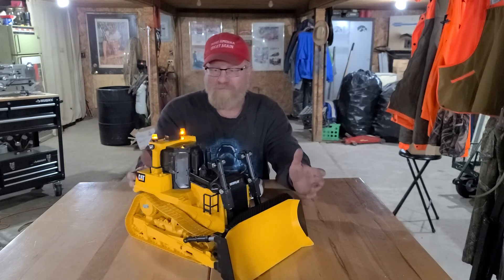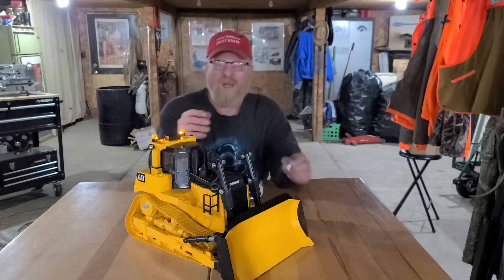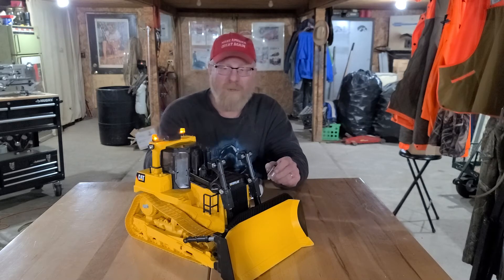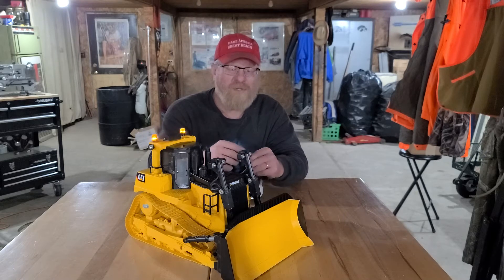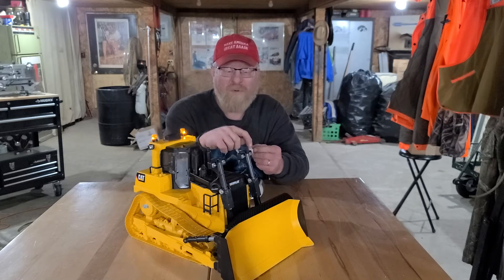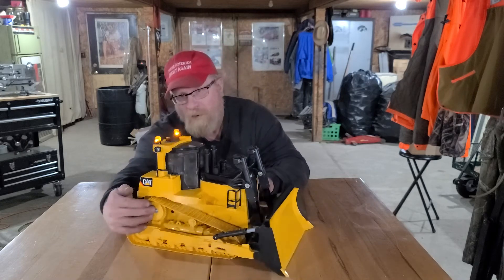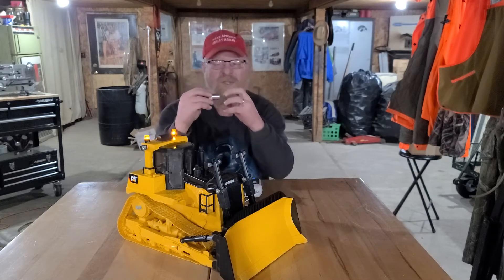To mount the drive sprockets, the motors have an 8mm D-style shaft — which is huge. I took a piece of seven-eighths aluminum, drilled it from the end, drilled and tapped for a set screw to catch the D on the shaft, then drilled two holes in the end to bolt the sprocket up, and machined it down so it's a snug fit inside the factory plastic sprocket.